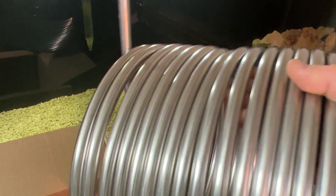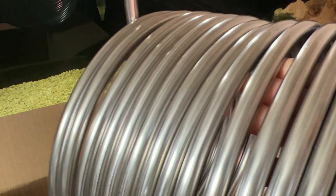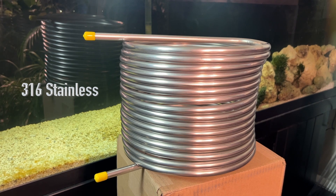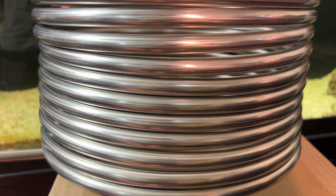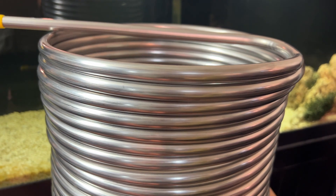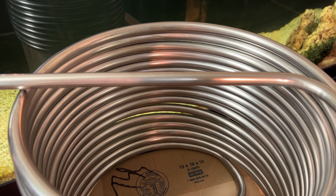This is what I came up with. I started with a stainless steel coil from the beer brewing industry as a heat exchanger — something the aquarium water can flow through to make it cool. Stainless steel generally comes in two grades: 304 stainless, which is good general-use stainless, and 316 stainless, which is more corrosion resistant and better for saltwater or acidic applications. Plastic won't work for this application because plastic is an insulator and doesn't transfer heat or cool very well, and other metal piping like copper is very toxic and dangerous to some aquatic life. This stainless steel coil would become my heat exchanger, at a price of $168.